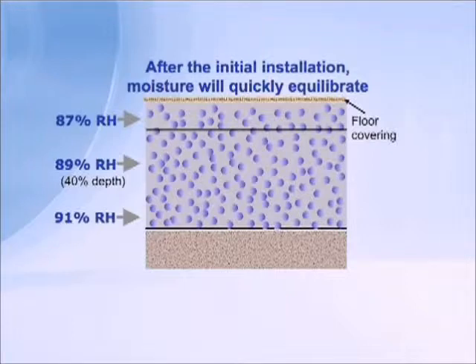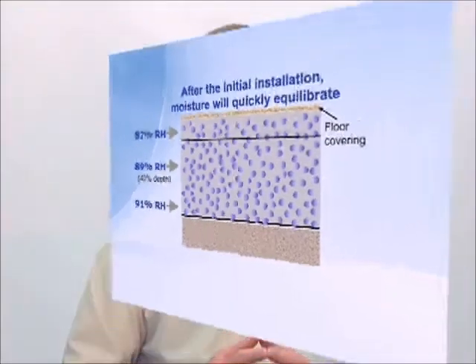That could be a dangerous relative humidity level. This is what happens in a slab. So it's very important that we are measuring only at the equivalent depth and not getting a watered-down reading. This is where one of the major advantages of the RapidRH comes into play. Let's look at other methods that use a sleeve and an external probe — the RapidRH system does not use a sleeve, but we'll get into that in a minute.